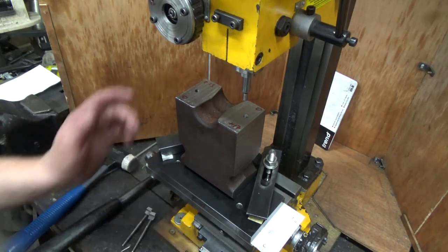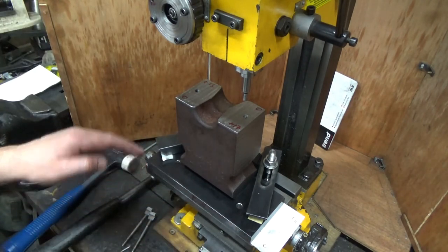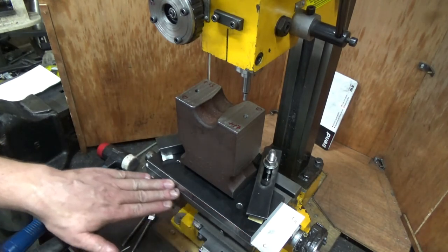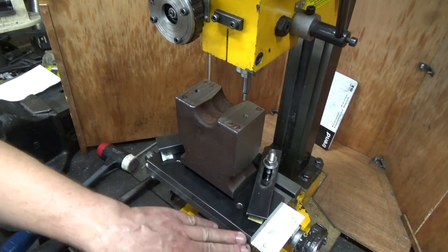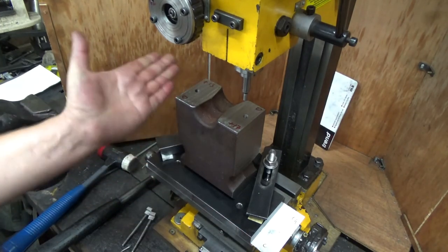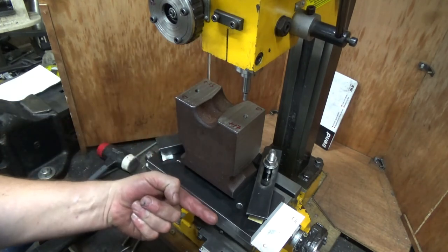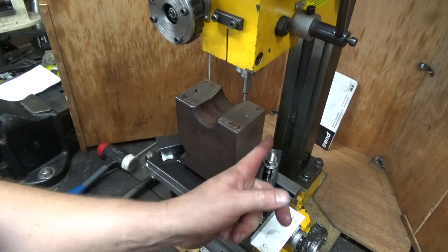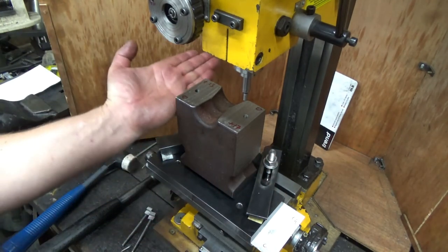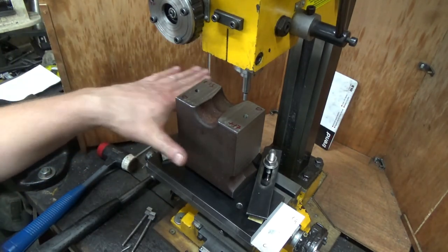Now when I milled this, obviously I milled it with just that end flat down to the surface. And this is pretty much perfectly parallel to that side there. So anyway, I've squared it up off of this side here because it's milled clean. And then I've twisted this block a little bit. I've just clocked it in, and this side is perfectly parallel to that there. And this side is 2 thousandths off. So it's pretty close, but this side is bang on parallel. So if I want to put any attachments on, this is the side to do it on.